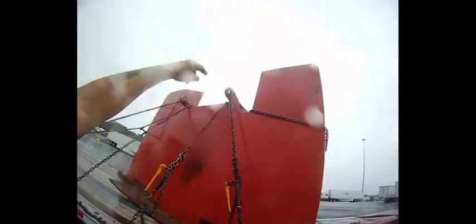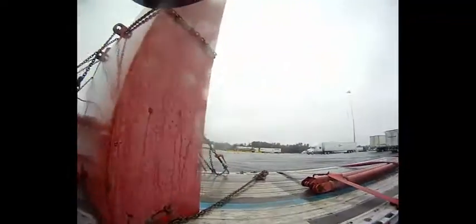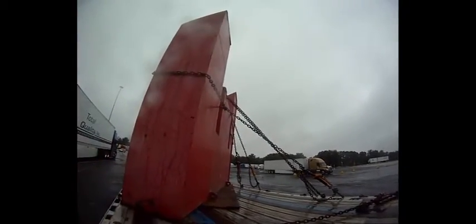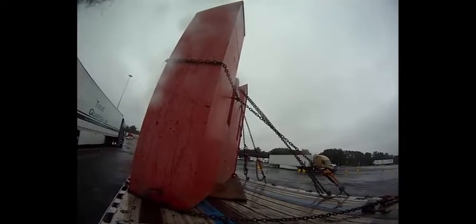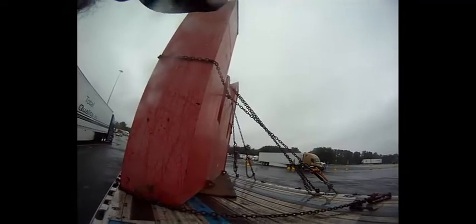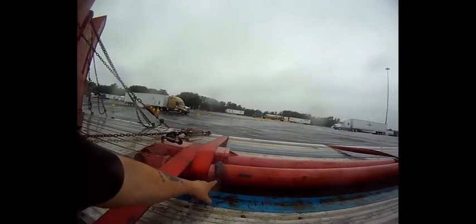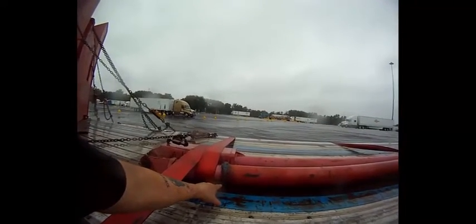Going up through those eyes and over the top was the best option. A lot of them, if the steel is too far inset like the ones way back there, I couldn't quite get any shackles, so I just decided to go chain wrap over the top. This chain settled and it looks like it's contacting but it's barely. On these boom arms, something you gotta watch for — I saw grease, which is a dead giveaway. I asked if this telescopes and they said yes, but they couldn't tell me if there's a stop in there.